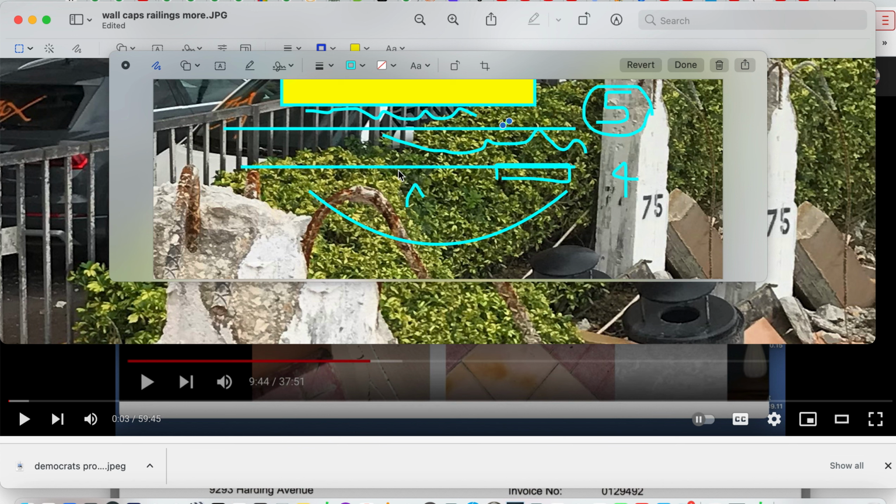But in reality, it's the bottom steel first spalled and ejected this area here, and then the new behavior of this beam is now without this reinforcement playing along, and it's playing along to some degree, a very, very minor degree. And then what's left is now this concrete behavior with whatever steel's left.